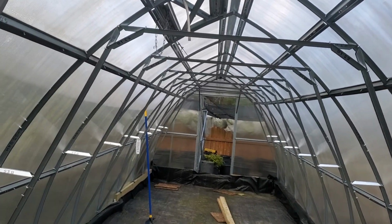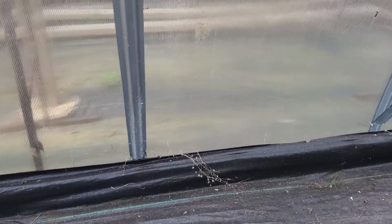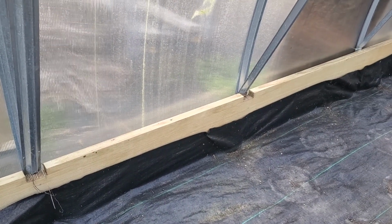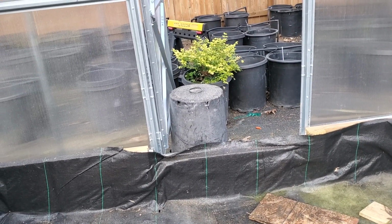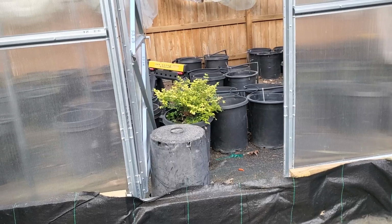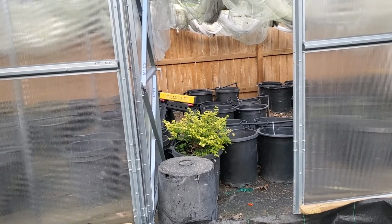Now, as the ground sloped, we had to go to 2x8s and, to close it up, to have something to go to, all the way to having these 2x12s. So we kind of had to jerry rig it. You can see the door there's level to the ground, the metal door frame across the bottom. And over here, it's about a foot above the ground. We realized this after we concreted some stuff in, and to take a lot of the stuff apart and redo it the right way would have been another week or two. And my friend was on borrowed time visiting from New York, and we needed his help.